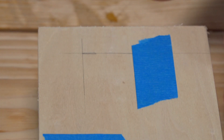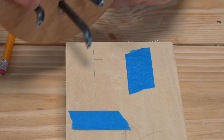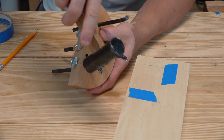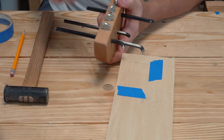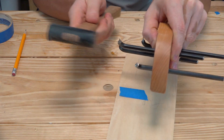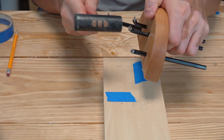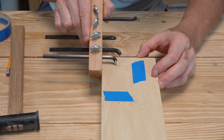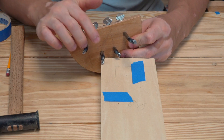I'm going to use this mark to set the first set of cutters on the gauge. Cutter number one and cutter number two — I'll use these two cutters to set the distance here, adjusting by hammering back and forth. The first one is set. Now setting cutter number two — it's about an inch off, so I'll hammer it out. About less than a millimeter away now, just a light tap. These two cutters are now set to the exact width.